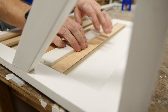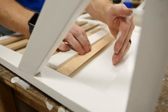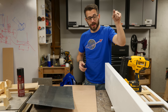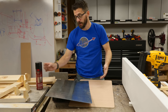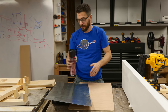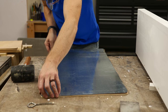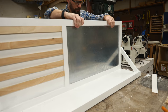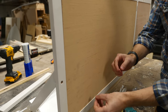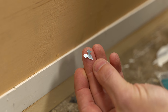I ended up leaving some extra space at the top so there's just open space behind the shelf. You can't take the shelves too high or it won't be useful, but if you don't like the look of that extra gap you could always add one more. I'm waiting on the glue to dry so I can screw those in place, so we'll start working on that panel. We've already got the metal cut and the wood cut — we just need to stick them together. We're going to use a spray adhesive for that; we've got to spray it on both pieces, let it dry just a little bit, and then stick them together. You could totally just glue these pieces in place, but I'm going to use some glazier points. These go in on the backside down into the wood using a point driver, but instead I'm just going to use a hammer.